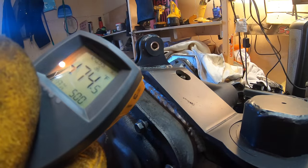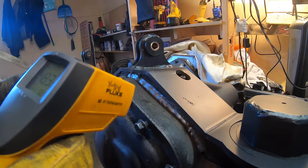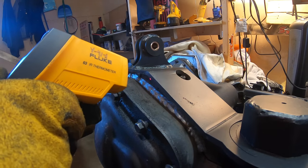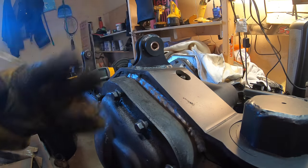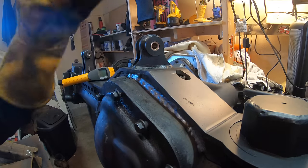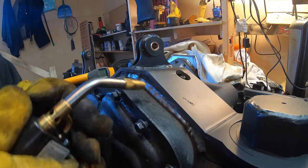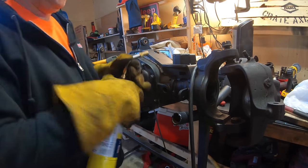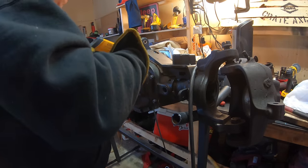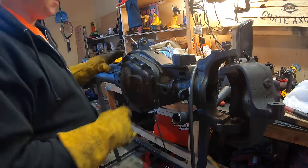Let's check some of the temps here. The cast is sitting at 350; the metal up here is a lot hotter right now because it absorbs heat quicker. What we're doing is taking readings of the weld, our steel, and our cast steel, and checking the differences between them — heating the lowest one up to match the other so they're not contracting at different rates while cooling. You don't want to start heating above what the other material is because then you're defeating the purpose of a post-heat. We're going to slowly bring this down until it's around 200 degrees, then wrap it in a blanket. This part can take 20 to 30 minutes depending on how hot it got during the weld. We'll repeat this until it's cooled down to 200.